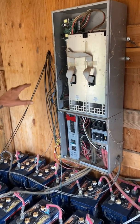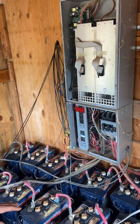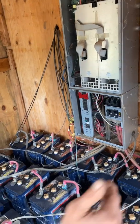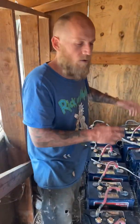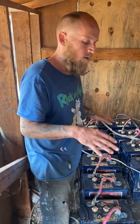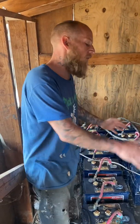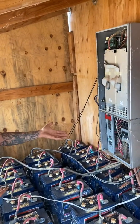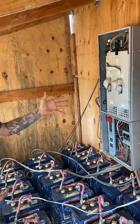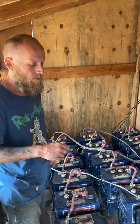This is where your battery is stored. A lot of times when people are thinking about solar power they immediately just think of the panels and think the panel goes right to the system, but really if you're going to go live off-grid the first thing that you want is a generator. The generator you can run no matter what — you just need fuel. Then the second component is this battery bank and the inverter, because then you can use the generator to fill up the battery bank and live off of it, trying to minimize your power usage. You also need the inverter because it transfers that 48 volts into a usable 240 volts over at your panel, and that's where it gets distributed at your house.